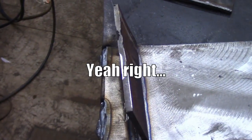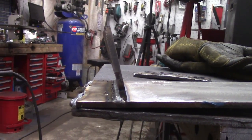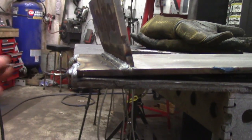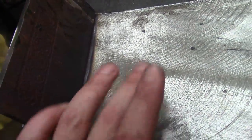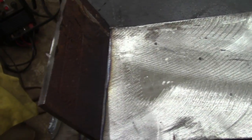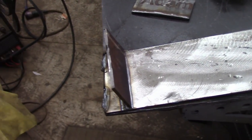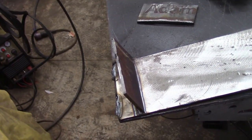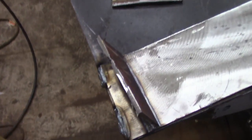Alright, that's it — I got 28 hits, four times as many as the other side, and I'm giving up. This thing isn't going anywhere, and even if it does the test is clearly conclusive at this point. In fact, the welds holding this plate to the table are actually starting to give up as well. Low alloy steel — if you're joining something with medium or high carbon content to something else like mild steel, it does make a difference. Seven hits with the sledgehammer on the backside of a weld is still pretty substantial, but clearly this is better.